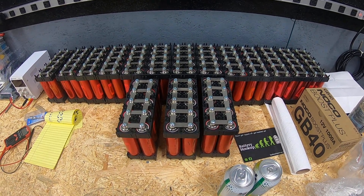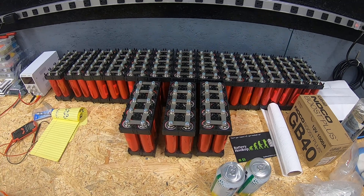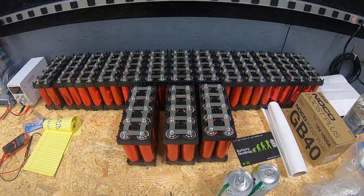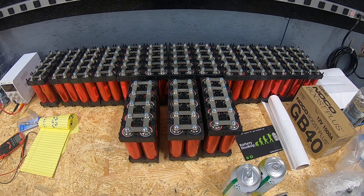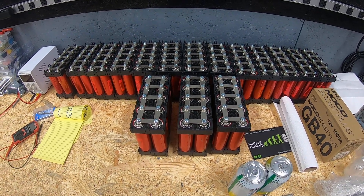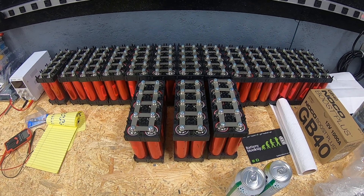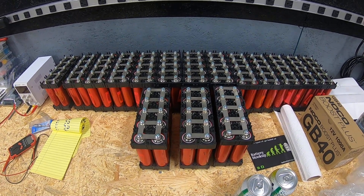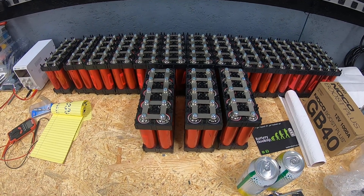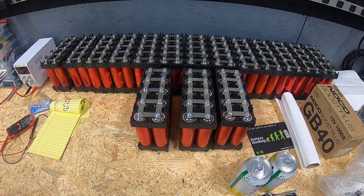What we typically do: we have an Outback Radian inverter 8,000 watt, which has a very nice key feature — it will blend solar power that we generate as well as utility power together. If it's during the day and we don't have great sun, we can still pull everything we can off solar and make up the difference with grid. The reason for the bigger battery bank capacity is that in the evening hours we do run the house off the home system. We want to increase that percentage, try to run as much as we can off that battery bank without depleting it to an uncomfortable level, and then be able to recharge and power the house the next day.